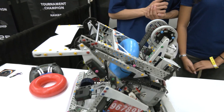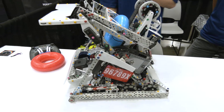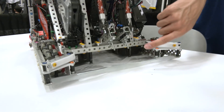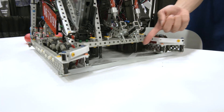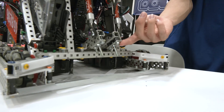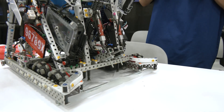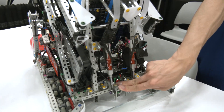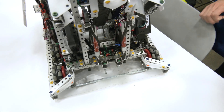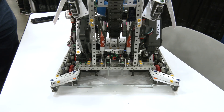One of the things we were talking about earlier — made some great improvements to your mobile goal clamp. Something really special that I don't really see on too many teams is that we run screws all the way down — four screws — and we use jam nuts and nylock nuts here so that this keeps the mobile goal clamp super consistent because of its ability to self-lock. With its ability to hold the mobile goal efficiently with this four-bar kind of structure, we're also able to steal mobile goals from other teams or score rings onto them as long as we clamp onto it.